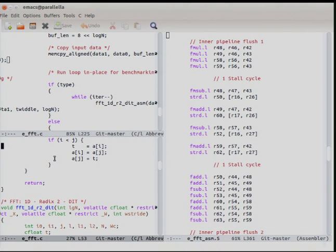People who do like us, C code is fine. And then on the right-hand side there, you see the assembly routine that he wrote. The fact that you have 64 registers makes assembly programming trivial because you don't have to rename a lot of things. Besides optimizing the pipeline and the algorithm, you don't have to optimize registers, right? So there's only two or three knobs to tune rather than four. That's programming the Epiphany at the base layer, right? I mentioned OpenCL, MPI, OpenMP. That would sit on top of the C code. But at the base level, it's a C programmable RISC processor, not unlike any one of the ones that you know.